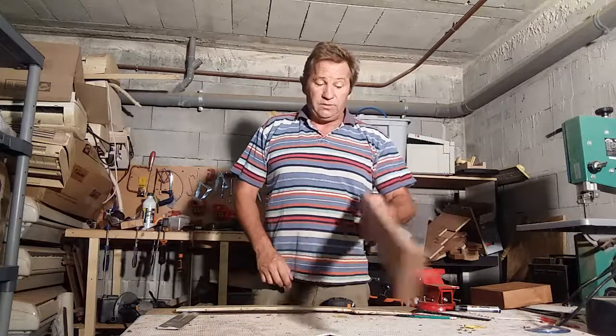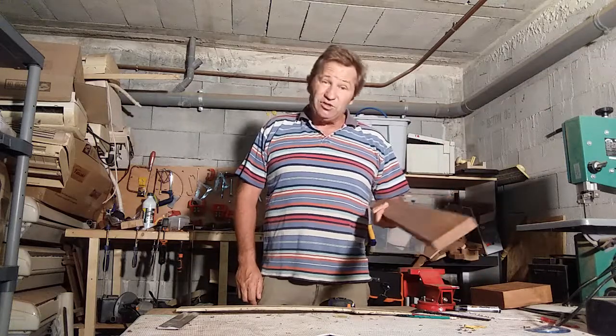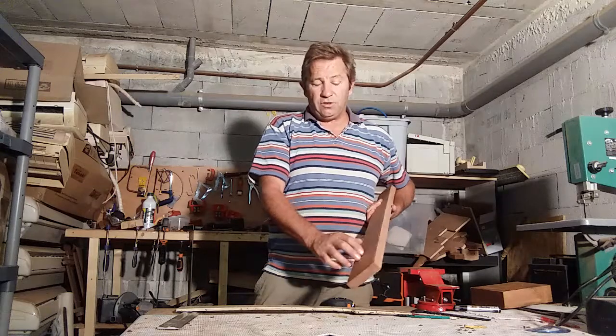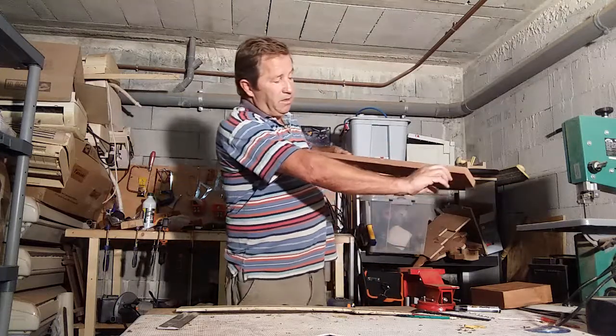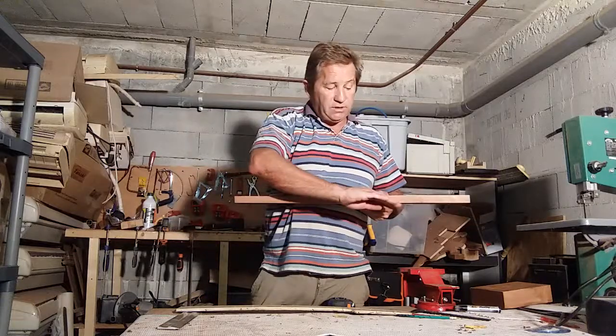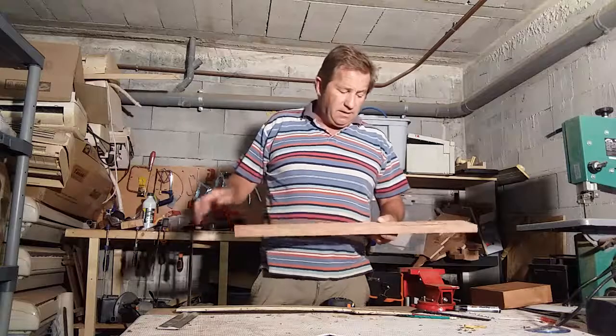You can also use 20mm wood. Once it's got a fingerboard on, this will be the right thickness. And it's also very strong as well. A scarf joint on the back is a lot stronger than, for instance, Gibson use 2-inch wood and the neck will be cut like that, and then you put two sides on here.